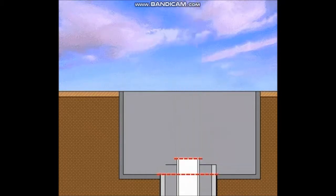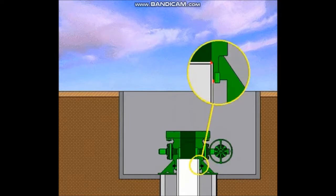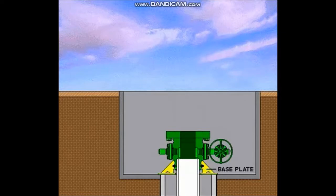When the final cut on the conductor and surface pipe is completed, the casing head housing is prepared for installation. The casing head housing is welded in place on the surface casing — welded on the inside diameter and the outside diameter — then tested to assure there are no leak paths in the welds. This test checks the welds but does not test the integrity of the casing head housing. The base plate, which is slightly larger than the conductor pipe, may be tack welded to the conductor pipe if desired. The base plate serves as a means to transfer weight from the casing head housing back onto the conductor pipe.